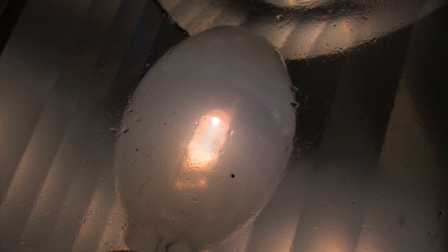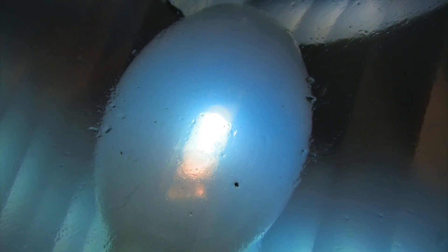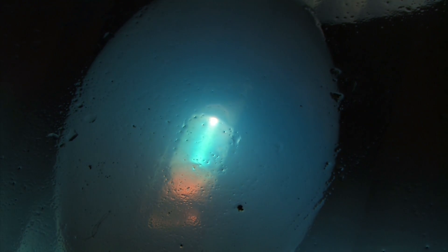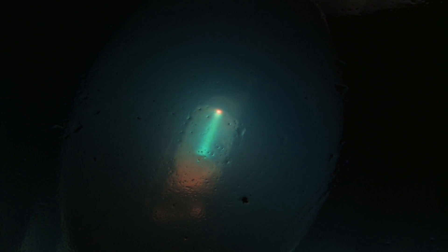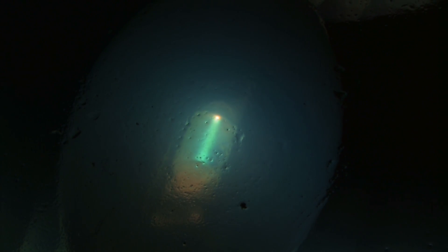The lantern is now mounted in place. The reason the image looks so dark is because I've got both ND filters switched on, so that you can see the light start up without me having to constantly jump around with exposure too much. Powering up now. This will just go through all the conventional metal halide lamp startup procedures, and you can see I'm just dimming the picture down so you can see the arc a little bit better. Already it's pretty bright and it hasn't even been on for very long.